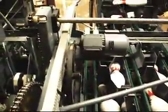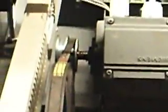I came back here and started this machine this morning just to check it out as I was going through some checkups. I noticed the table motor is making some horrible noises. That wheel on the table motor itself is starting to come off. You can see it's not aligned very well with the pulley wheel — it's going to the left side of your screen. We need to get that gear wheel back over on the motor properly and reset that set screw.